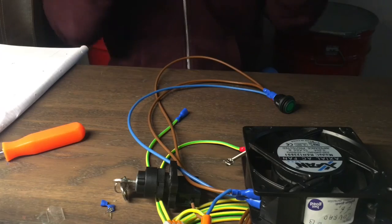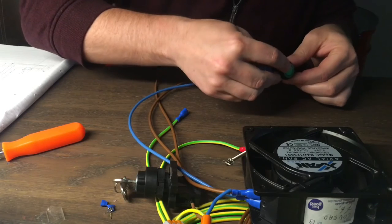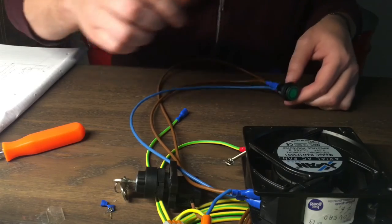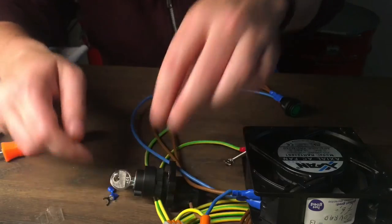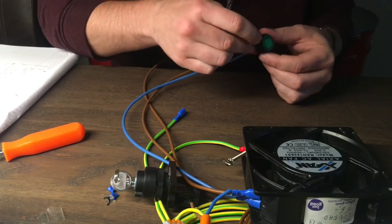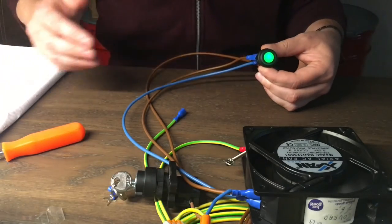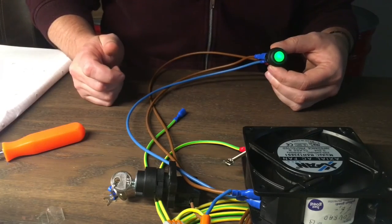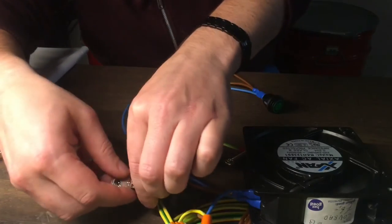Power is connected — let's give it a test. Key switch is in the off position, blocking power: light doesn't glow, fan doesn't spin — that's what you want to see. Switch the key switch on — light still off, which is great. Turn the rocker switch on and you get fan, you get light, everything is working. Key switch problem done, rocker switch problem done.